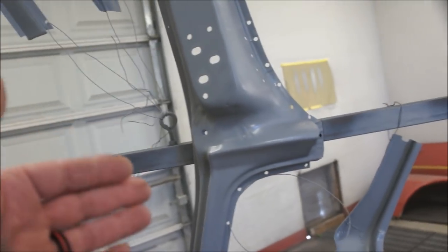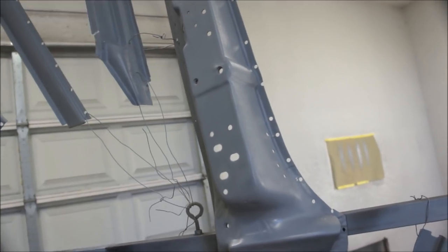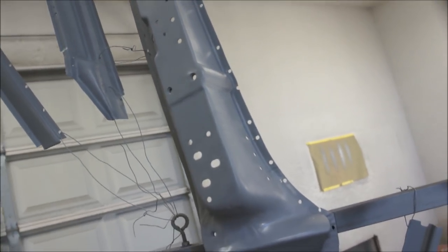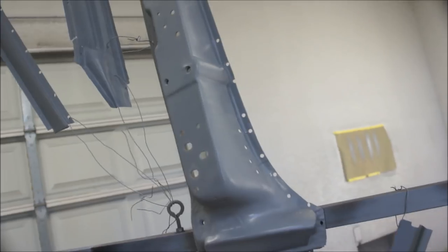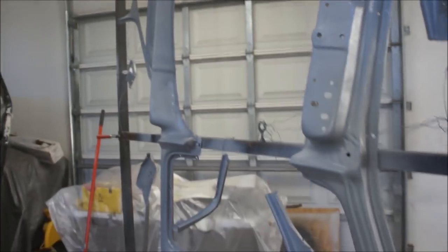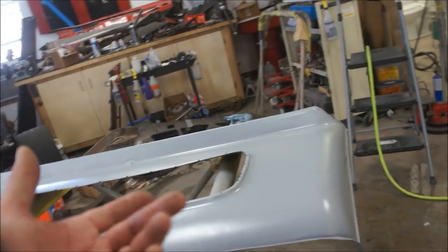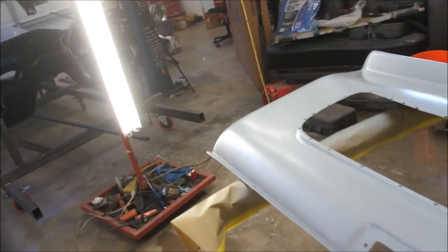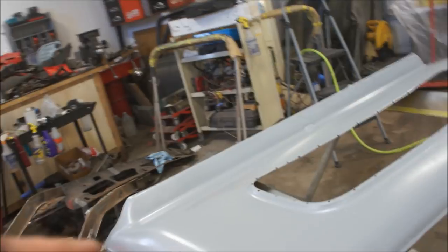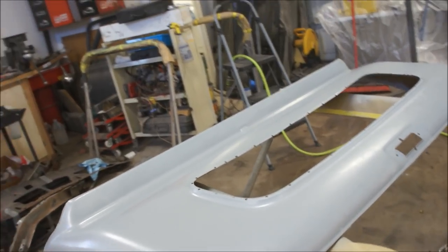But the next coat I'll actually tone down just a bit and get to where everything's more smooth, fluid motion type deal, and try to get a little bit more coverage, a little thicker on the second coat. So, yeah, I just thought I'd throw that in, at least with this epoxy. Now, every epoxy is different. So for me, this SPI, I found that if you spray a lighter coat, it seems to jive a little better. So, at least on the first coat. All right.